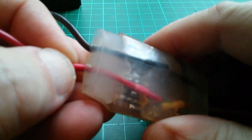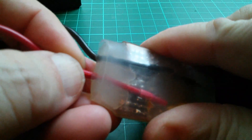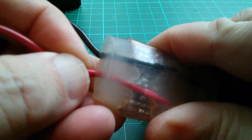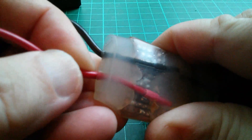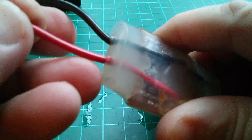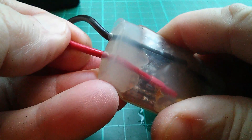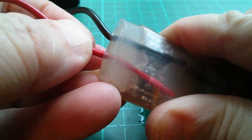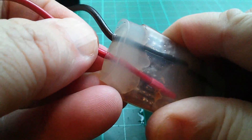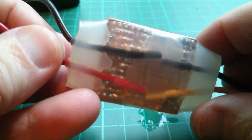You can also see moisture running up along the red wire there as I move it — inside the plastic there's actually room for it to move. You can see the plastic moving both on the outside and the inside, so moisture could have got through there, which is odd. I know that the grip between the hot glue and this PVC wire wasn't a good adhesion but it certainly was a tight fit. I've not had very many go like this where water's got in, so it's quite surprising.